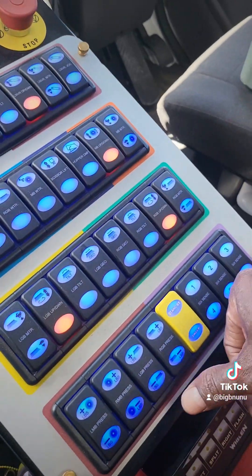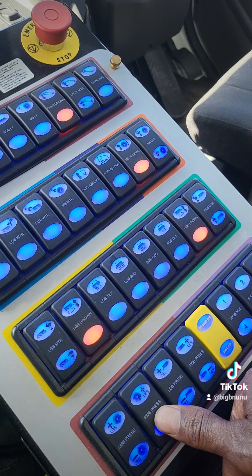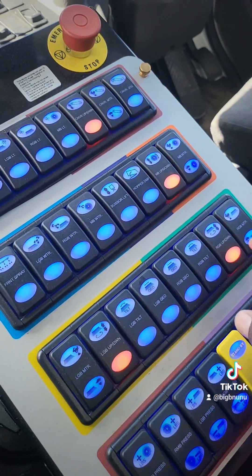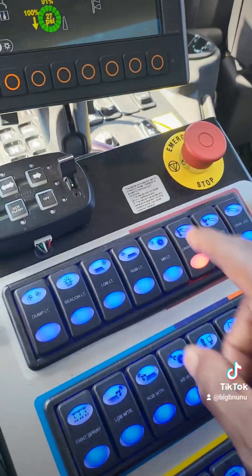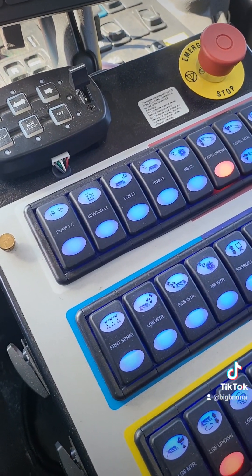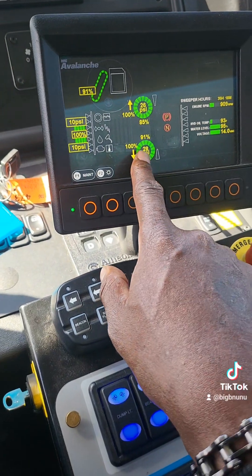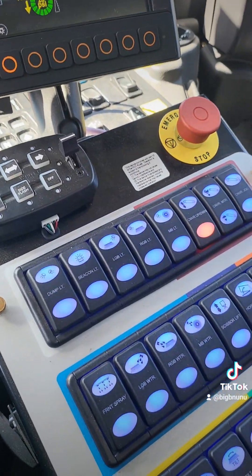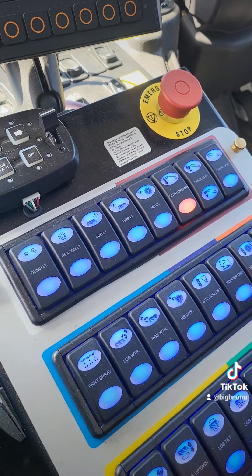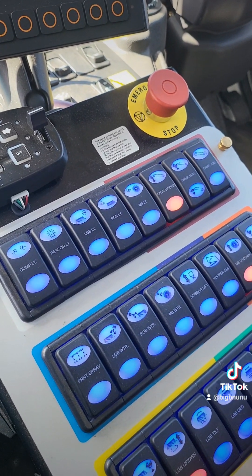For the main broom, if you want to adjust it, you go down here - these two are for the right and for the left; you can put more or less pressure if you want. Same thing with the gutter brooms tilt. You can adjust the pressure PSI - I bring the pressure to 27 to 28, that's where I keep it. As you wear them down you're gonna have to adjust it, but it's self-explanatory. You can raise the RPMs up or down like that.